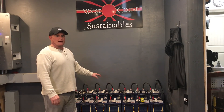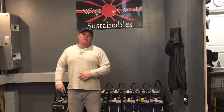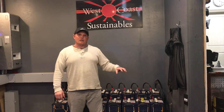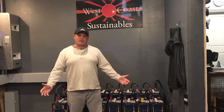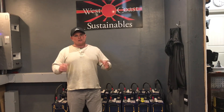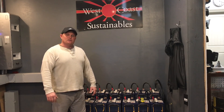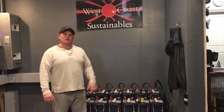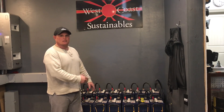One of the things we'll show you after we look at these batteries is we also have our existing system, and we're actually building another system in the wood shop so we can power that independently. I picked up some used inverters and got some batteries from Outback to play with. We'll go over and look at the new nanocarbon batteries — completely sealed cell, no equalization, no maintenance of the battery cables. They can sit at what they call a partial state of charge, so it's going to be interesting to see how those batteries compare running some of the bigger loads.